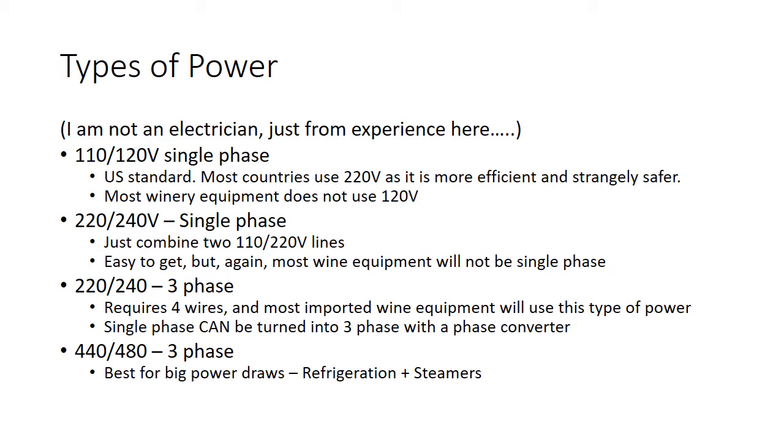As you go up in voltage, power becomes cheaper because the power company doesn't have to step it down. So for things that are big power draws — like refrigeration — this is where you want to use that high-voltage stuff. Our big draw in the 480-volt range is for our forklifts and charger, as well as when Signature pulls up with the bottling line for steaming. Just know that when you go buy a piece of equipment, you can't just plug it in — consult other people. It's just to make you understand that you've got to think about what you're going to buy and why.